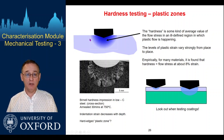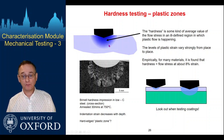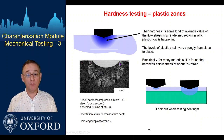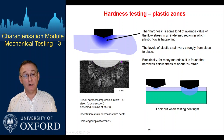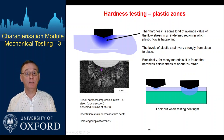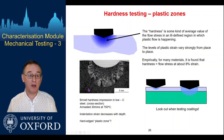A good way of making the deformed region apparent is this example: a Brinell indent made in the surface of a low-carbon steel, sectioned through. It was a well-annealed material to start with, the indent was put in, generating deformation in the material around it. When we then anneal that material, we find it changes the microstructure, allowing us to pick out the extent of the plastic zone. There are larger grains at the periphery of the plastic zone and a much finer structure closer to the indent due to a plastic strain gradient. Eventually, if you go outside the zone, there's no plastic strain at all.